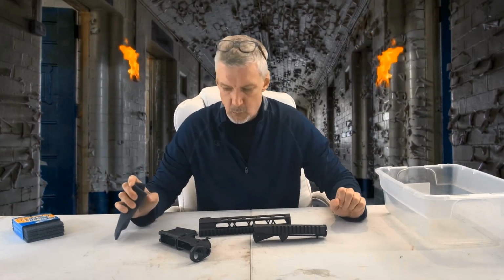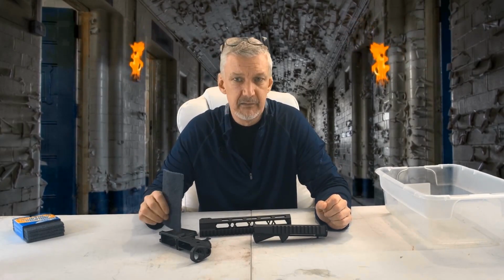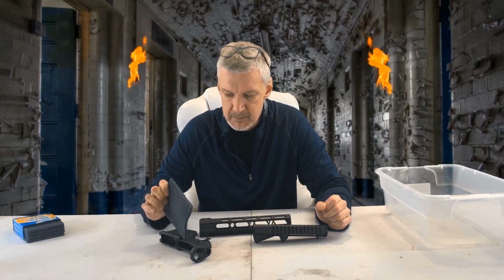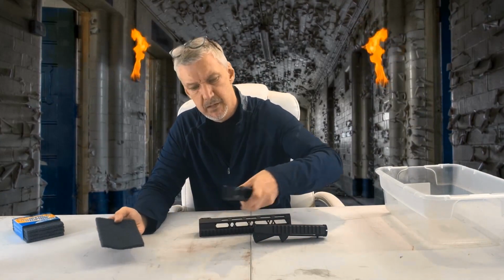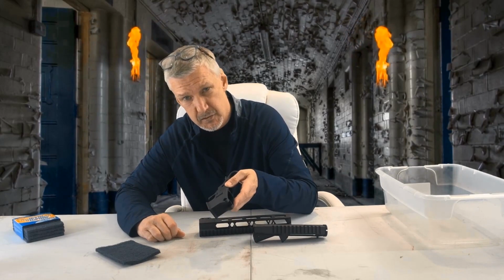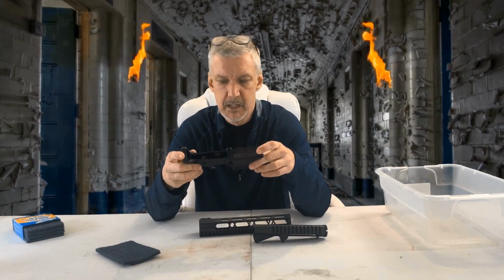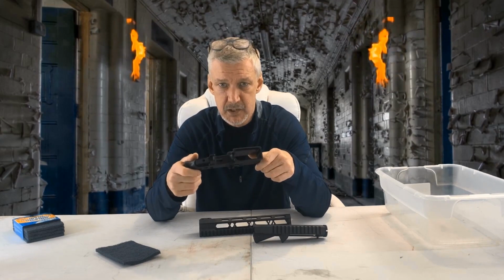So what you first want to do is rough all of these up. Get a Scotch-Brite pad and scrub every bit of the surface that you want to Cerakote. What you want to do is remove the shine from all the surface areas. That's going to help the Cerakote absorb into the material. It's going to give you a much better finish.